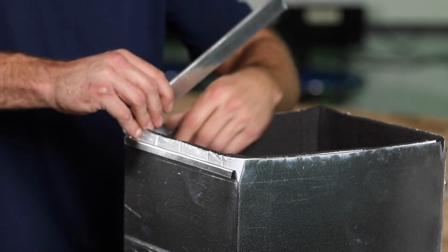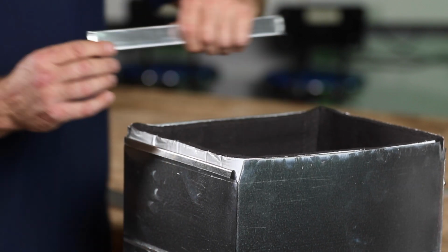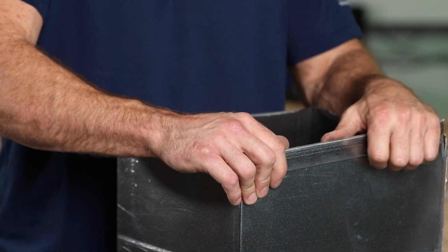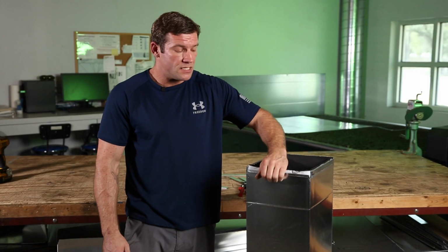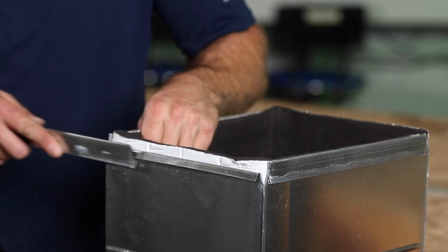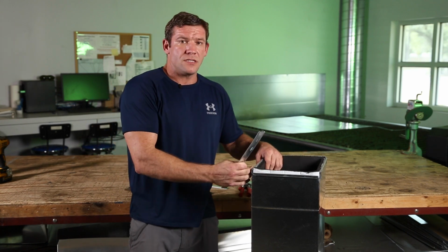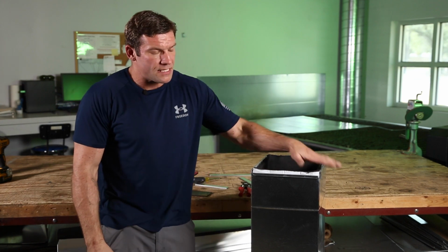It won't come loose. You're gonna slide a piece of S-lock here, right? And you're gonna put another piece of S-lock on the opposing side. And this is normally gonna happen in the field because, as I explained earlier, the mechanic might have a decision on where he wants this ear to be. And the reason he might have a specific spot he wants it is because when you connect another piece, it slides into this drive. So if I'm working in a web truss, I need to be able to slide up. And if this ear is on the opposing side, I couldn't get to that top piece to slide that in. So now this has S-lock and drive on it.